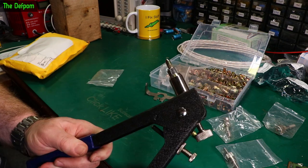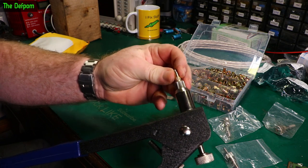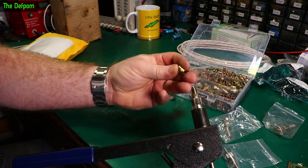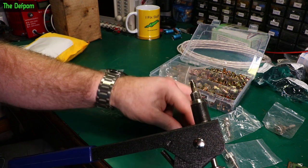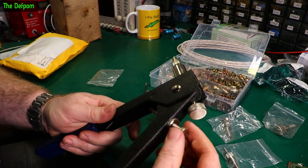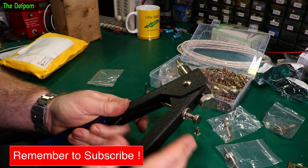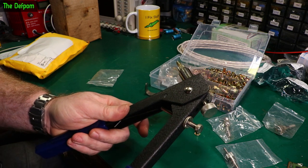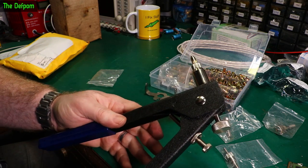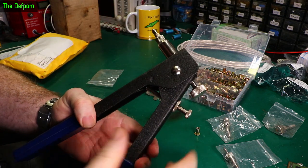And that will collapse the nut part and pinch the plate. Should have got one of these things years ago. So let's actually try and demonstrate one. I've got one which is about the size I actually want to use — I've got a bit of a job I want to do with this right now, which is why I'm recording this. So I've put one on there, it's about 5mm or something like that. This is like a limit to find out how much you actually squash it by. I don't know how far this should be set to minimise how much I try and compress by, because if you try and overdo it you end up stripping the thread out or something. So I'm just going to try it like this and see how much it crushes and adjust to suit.